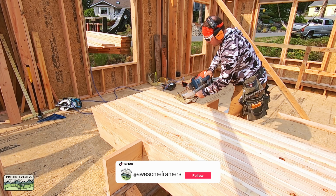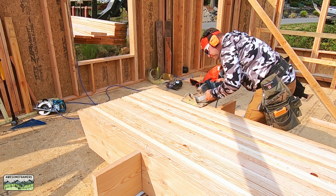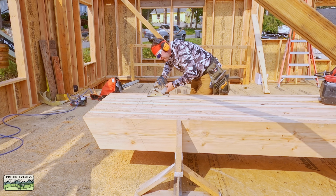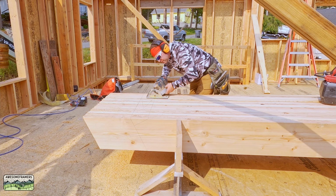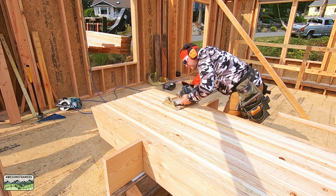Okay, so how do we make the seat cut? In this case, because it's a 6/12 roof, I need to be able to tilt my saw to 63.5 degrees in round numbers. So I use the Bigfoot Tools 10¼ inch beam saw with the swing table. Again, bigfoottools.com, link will be in the description.